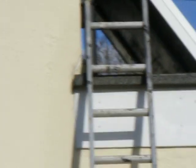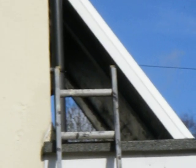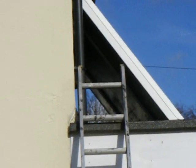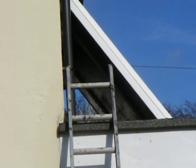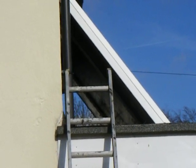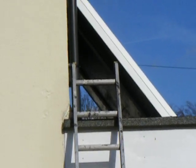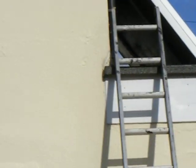For the conditions, it's at an angle of 52 degrees roughly — trigonometry was okay. Angle of 52 degrees to the ground, which a couple of websites I've seen say is the recommended angle for this latitude — 52 degrees north here in the UK. Right, let's go up the roof.